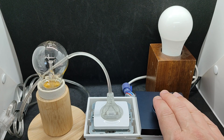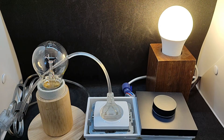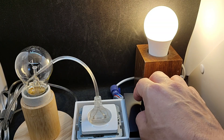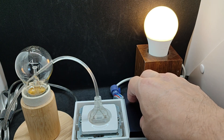Unlike the previously discussed smart load mode, automation depends on the gateway's functionality. In this example, the light bulb will turn on and off with a single press. For rotate and rotate with press, only smooth adjustment actions such as brightness and color temperature are available, depending on the device you want to use in the automation. A single press now not only switches the state of the first relay supplying power to the incandescent bulb, but also controls the Zigbee bulb through automation. Brightness adjustment by turning the knob: at a low sensitivity level it changes slowly, and at a high level it changes faster.